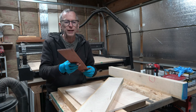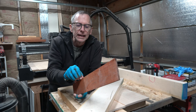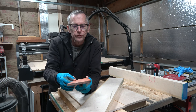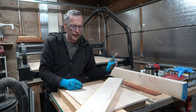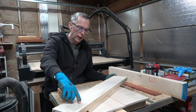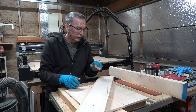Okay guys, there's a change of plans. This piece of padauk I just showed you has a section where it's just too thin. If I were to plane it all to the same thickness, I think it would be too thin for this conical multi-scale fretboard with a conical radius. So instead of using this I'm going to set it aside for a future guitar build. What I'll do instead is use this really nice piece of flamed maple — I'll cut it down to the correct width, and out of this blank I can probably get three fretboards. So that's the plan — now I'm going to start cutting.